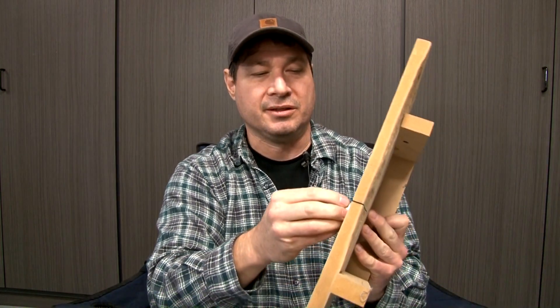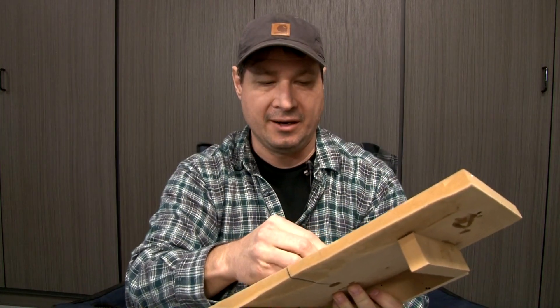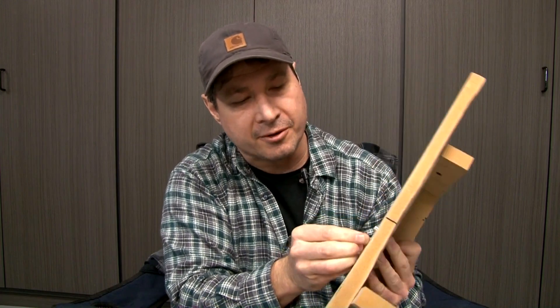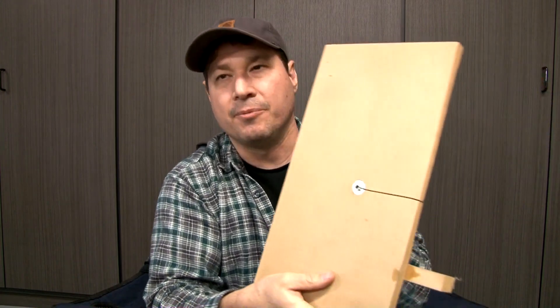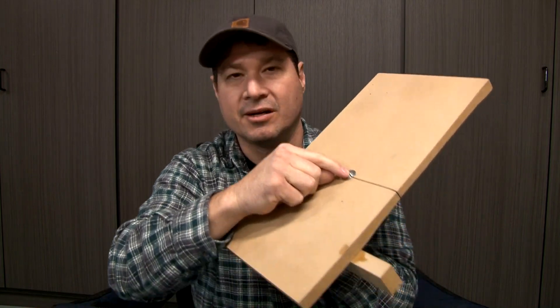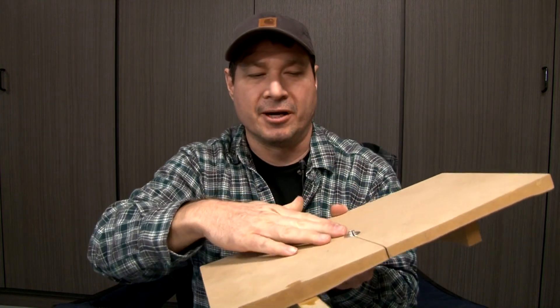For those of you who've used a wood router before and know you can use a guide, that's pretty much what this is — except we're going to use it for a hot wire. Here's a little table I built, a cheap table made out of scraps, just glued some scraps together. I made the little adapter fit right down in there, and now when I put it on the table I can slide the wire all the way through and have it come out straight through the center of the little guide rail.